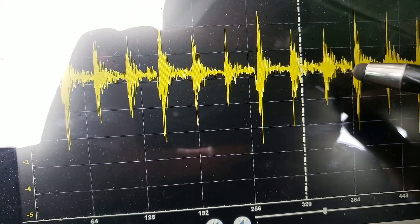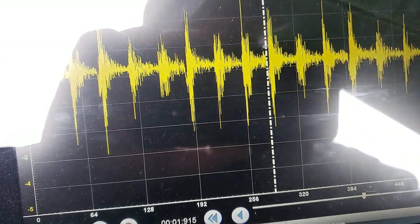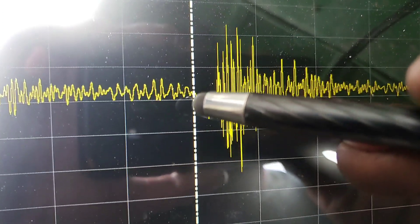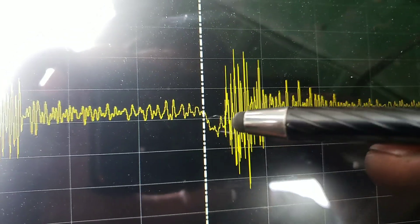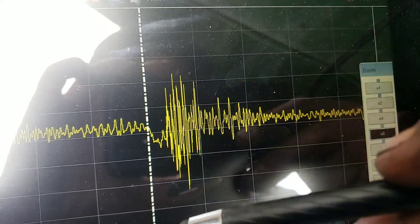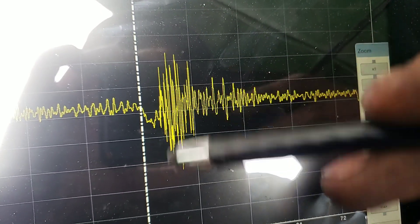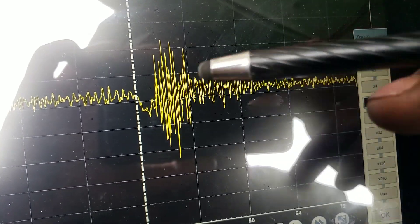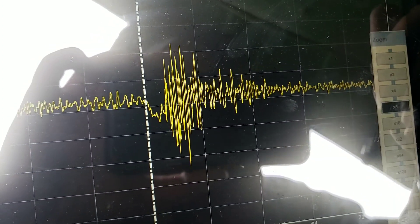Now that drop off there — let's see if I can get you zoomed in on that. We do have a relatively slow drop-off that leads me to believe that it's actually possibly sticking a little bit, and it's not fully opening. So that might be a carboned-up or crudded-up tip, a little bit of debris in there. But the pintle and the spring appear to be operating properly, although it's not building the type of injection pressure I would expect. We correlate high injection pressure and a clear nozzle with a high amplitude of fluid, because the fluid is going to come out at high pressure at a relatively fast rate and then shut down — we're not going to have those long drawn-out spikes like injector number two. But with this smaller amplitude, I believe it's having a harder time getting rid of the fuel.